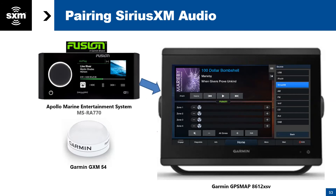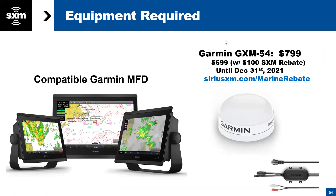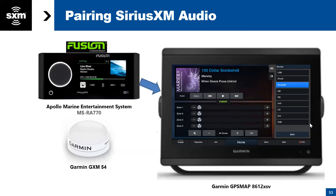There are two ways to get audio in. The GXM 54 can handle music, or you could have a separate SiriusXM tuner — if you have a separate tuner, you change channels only from the stereo. If you're using the GXM 54, from the Garmin screen select your source and you'll have two choices: it'll say Fusion or whatever stereo you have, and it'll say GXM 54. If your music subscription is tied to the 54, select the 54 and you can then control your audio from your MFD and it'll pipe out through your speakers.